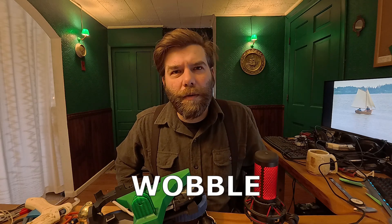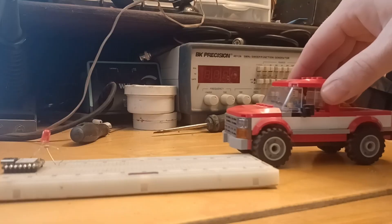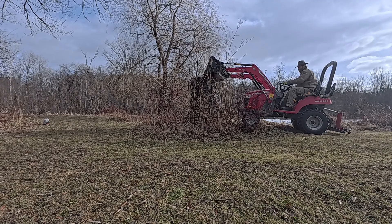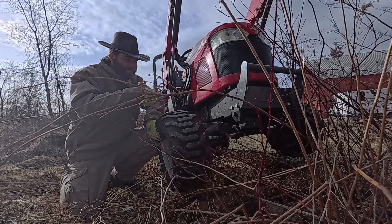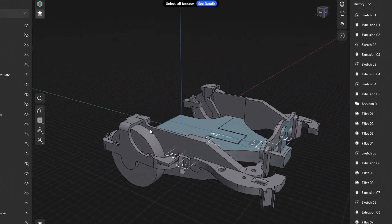The obvious solve for this problem is to use a four-wheeled chassis. Now the problem with that is wobble. On a perfectly flat surface, four wheels is great. But if you have any kind of bump, it's going to lift one of the four wheels. There are a few ways that this has been solved over the centuries of building vehicles. Industrial or agricultural equipment will often have a solid front axle that is pivoted in the middle and freely pivots one way or another. This gives the vehicle the flex, as the off-roaders call it, of a three-wheeled vehicle, but the stability of a four-wheeled vehicle once it hits the limit of the axle's tilt travel. But I wanted to try to do better than that, and I came up with my own weird system.